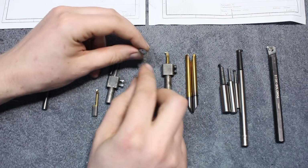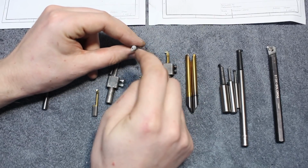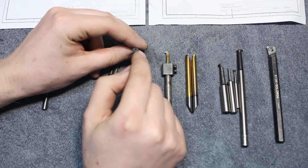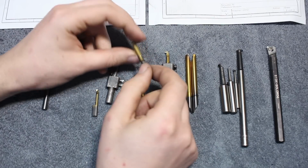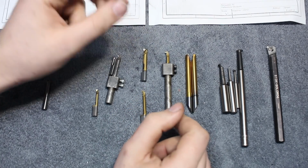They're relatively simple to make. You just have to measure the included angle of the teardrop shape, drill the ends larger because there are not relevant surfaces, only the taper is relevant, and mill out the angle between them. It can be done on a manual mill or on a pantograph machine or on a CNC.